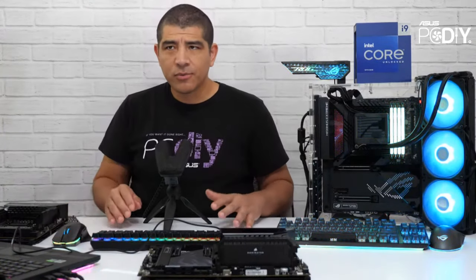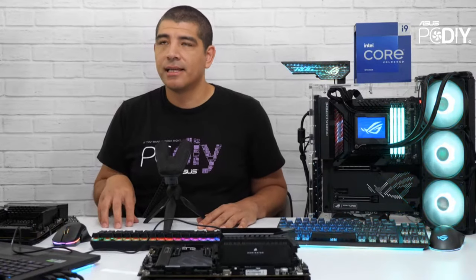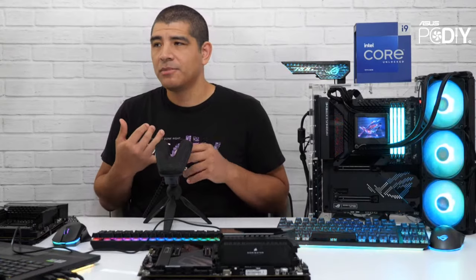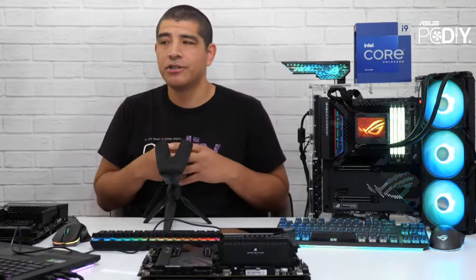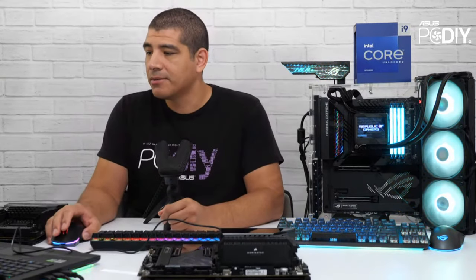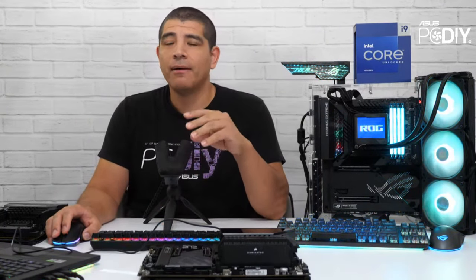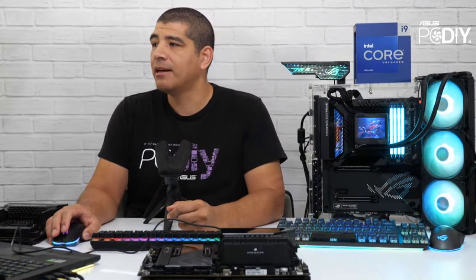And in case anybody's wondering about the DAC number on this generation, this is going to be the ESS9218. All the aspects of measurement, in terms of the THD and the signal-to-noise ratio, have been improved from even the prior generation. So tonality, detailing, and soundstage are an overall better experience. Overall, pretty sweet in terms of the upgrades. This board does also give you 10G and 2.5G, where most of the other boards were only going to be looking at 2.5G based networking. So do keep that in mind.